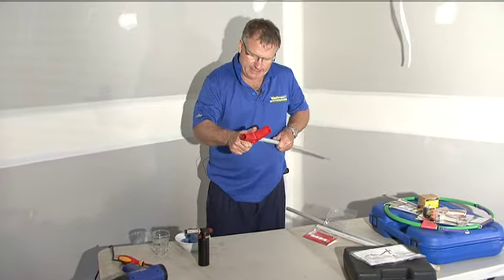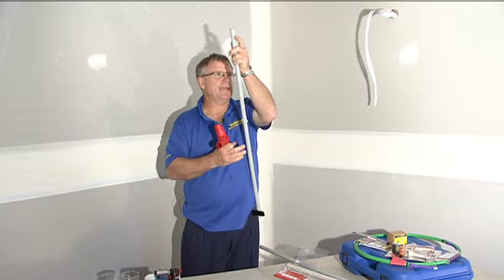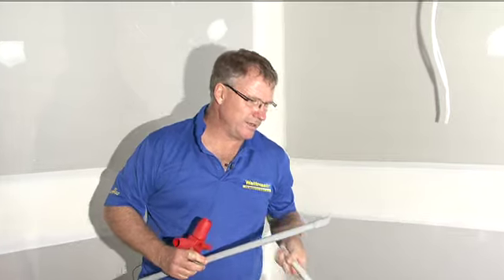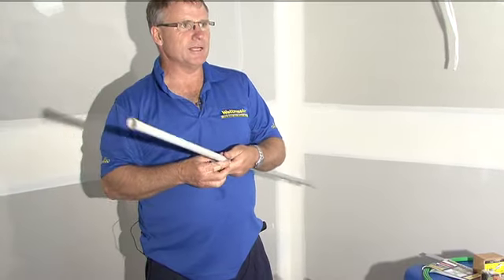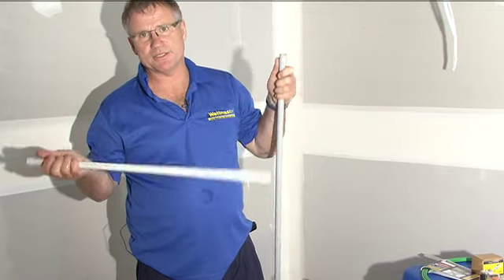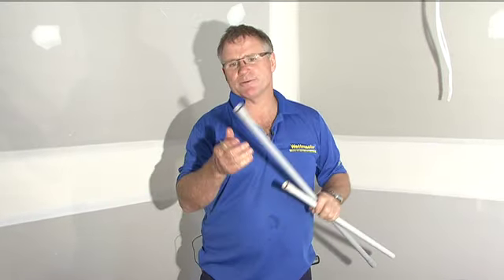It becomes a little bit stiff on the Bellmate, but with a little bit of force we have a perfectly formed bell, ready to join two PVC conduits. It joins perfectly with some PVC glue, and then you've got your join — especially useful on a concrete pour they're about to do, so you're not holding up the job just because you ran out of couplings.